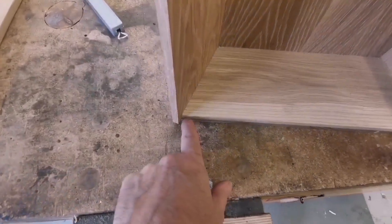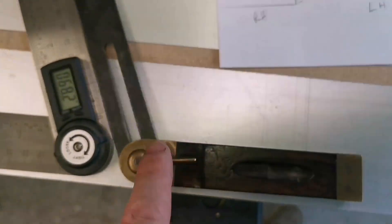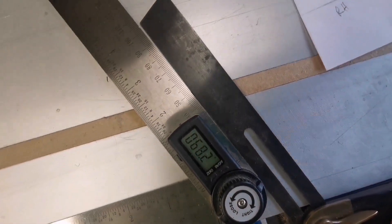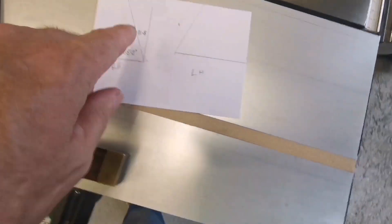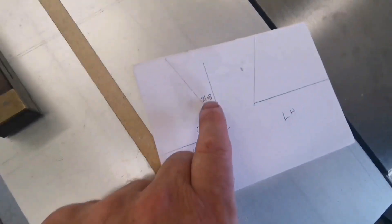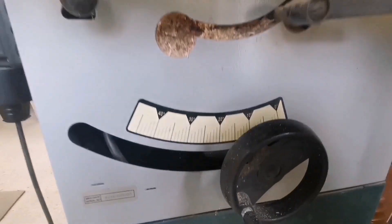Right-hand side — drawing around — that makes it 68.2 degrees. The reason I know that is because I set that up to the angle and put it against there, which brings it out to 68.2, which is great. But I need the other figure off the saw — not 68, but 21.8 degrees — because this goes the other way, from 0 to 45. So I need the opposite angle: it's 21.8. My saw needs some dust cleaned out of that before I do anything — I'll clean that out, then set it up to 21.8.